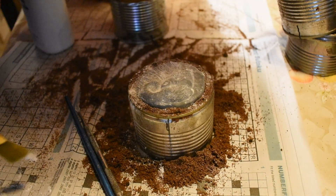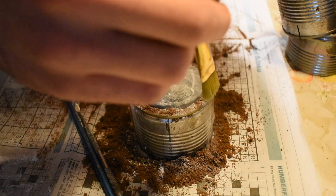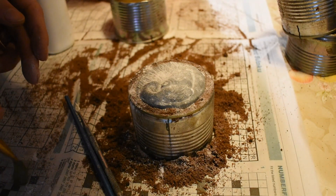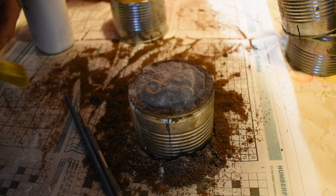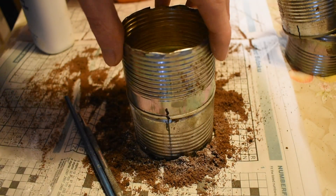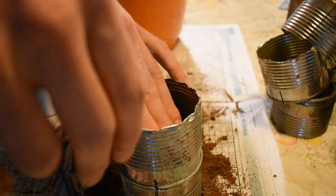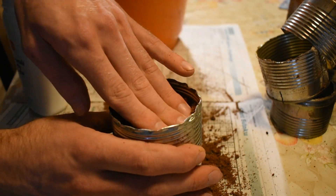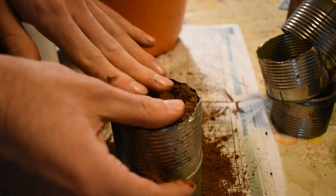After you've added a nice surface of talcum powder, put on the second layer and slowly add a little bit of sand, filling up from the other side. Make sure that when you're pressing you're not moving the sand from side to side — only pressing down so it's even pressure all the way around. It's got to be quite hard pressure, but if you accidentally push too hard and move the sand, it will take away some of the talcum powder and the sand will stick to the surface of your model.